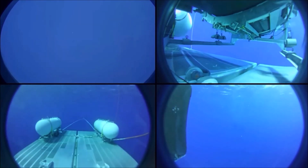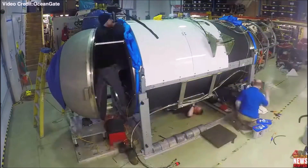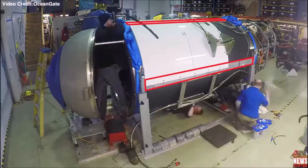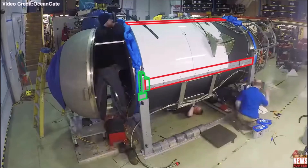I believe I have finally figured out their system with respect to the legs and weight carriage. Let's start with this picture of it being built — this shows a fair amount of detail. Here you can see the members that connect the interface rings together. It's not clear to me if they were meant to be anything other than a place to fasten the shell to, but they look substantial enough that they may have been intended to be a structural element to add some rigidity to the framework system. There are three of them at 90-degree intervals, and notably there is no such member under the belly. There is a fitting that joins these members to the interface rings, and it appears that this part was also used as a means to connect the legs to the interface rings.